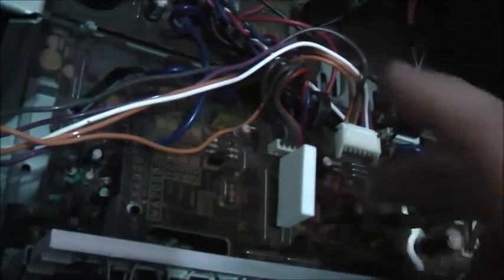I might end up finding another one on these boards, so if anyone's got one. I'll just get a hold of these transistors so I can change them here. These resistors are getting hot. Those capacitors may be bad then. I wonder if it's possible one of these has gone short. I have to trace the circuit. They're not warm though, just these are getting warm.